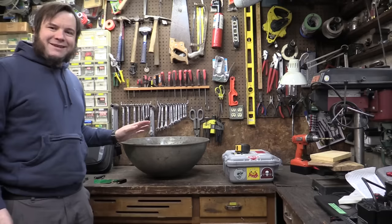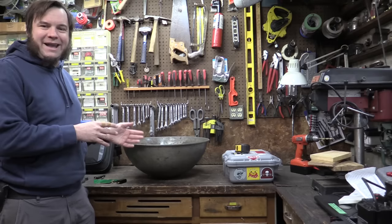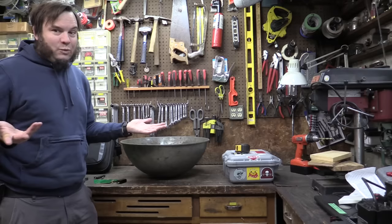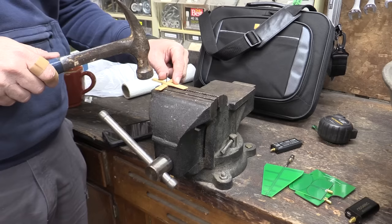But they should work okay for a linear polarization signal like the GOES satellite. Since I don't have super high hopes for this working long term, I'm not going to do any permanent modifications to the bowl — I could use this bowl for something else, so I'm just going to go as temporary and prototype as I can. You know we're doing a professional space-based satellite communication system when the finishing nails and random pieces of scrap come out.